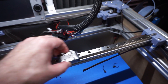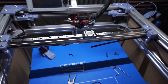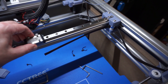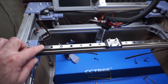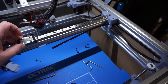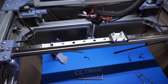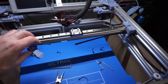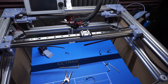I got a new linear rail. This one has a little bit of preload just to get rid of any slop that you sometimes get with cheaper linear rails that also sometimes vibrate and make noise. Mine was making a buzzy sound on certain speed moves, which was getting really annoying, so I decided to replace it. This one is 100% stainless steel rail and carriage so I don't get any surface rust, which I sometimes get just because I live in a coastal city. Anyway, I'm getting ready to put the carriage back on, reconnect all the belts, tension it, and probably try a new hot end.